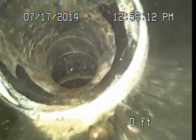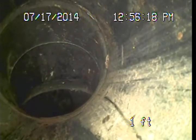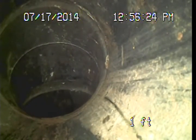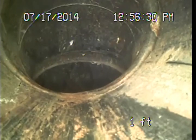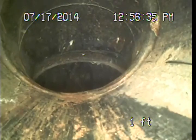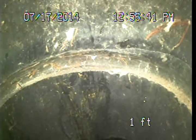As we get up here, this looks like the same old section of plastic that was in there — they just had pretty significant root intrusions right here in this area. You don't see any evidence that this was replaced. If you look to the upper right of the screen, that looks like a little piece of root or debris punching through that joint. So it looks like they just cleaned it out. And then beyond that, at this next connection, you see those remnants of some roots there.